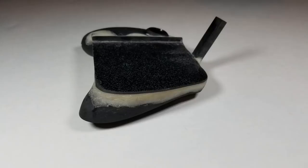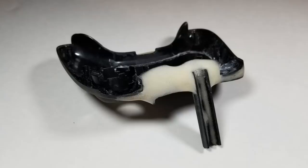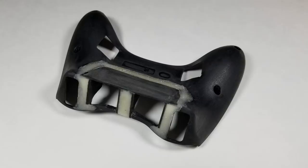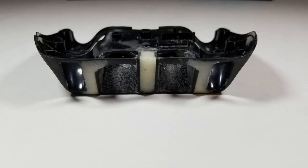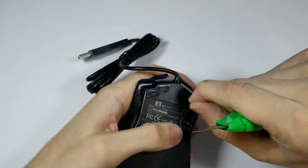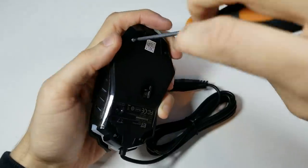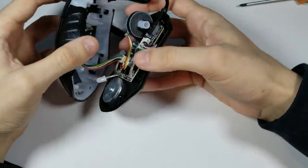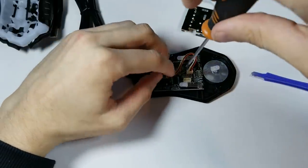First and most importantly, let's start off with how we created the mouse used on this controller. This was obviously one of our biggest challenges. When using a mouse in a traditional desktop setup, you have a large, flat, level surface to interact with. This desktop real estate is obviously not available on a controller, so we need to approach this problem from two major angles. First, we need to shrink the overall size of the mouse dramatically to around just the size of your thumb. As a mouse is designed to fit the palm of your hand comfortably, we can immediately eliminate the bulk of the mouse, as much of its build is just pretty plastic and RGB lighting. We can also eliminate things like the buttons and the scroll wheels.